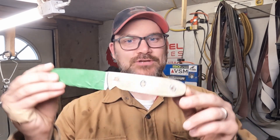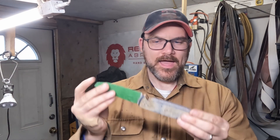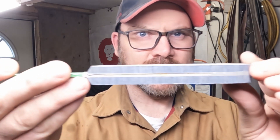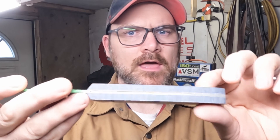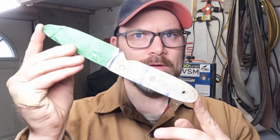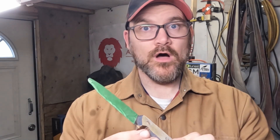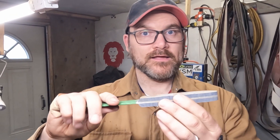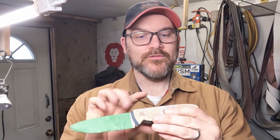It's not going to be a long one — basically just handle shaping, how I shape a handle. What I've already done is ground the pins flat; that's typically the first thing I do, since the pins will be sticking out a little bit. This knife has three pins. The next step you'll see is profiling the handle against the flat platen, right to the steel. Stick around and hope you enjoy as we shape a knife handle.